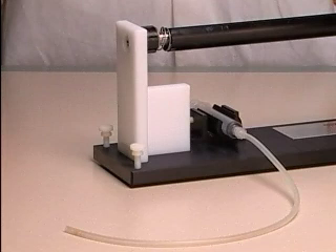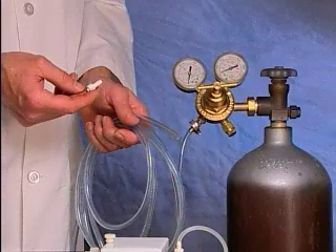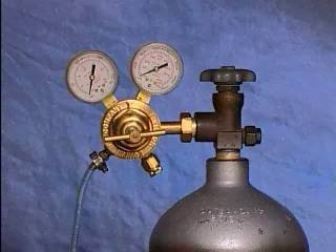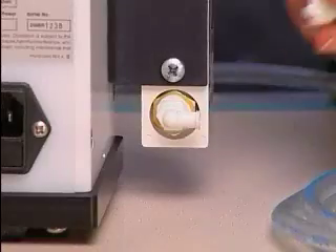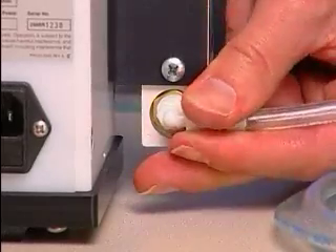The other syringe and tubing will be used to draw the gold ethanol suspension into the tubing. The tubing prep station needs to be connected to the nitrogen supply using the nitrogen hose and a large luer fitting. Connect one end of the hose to the nitrogen regulator. Fit the male luer connector to the other end and attach it to the female connector at the side of the tubing prep station near the flow meter.